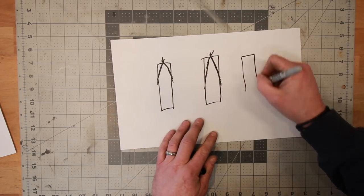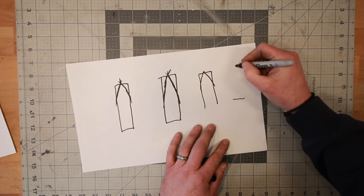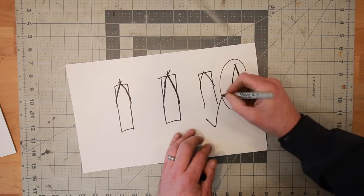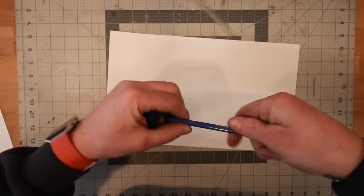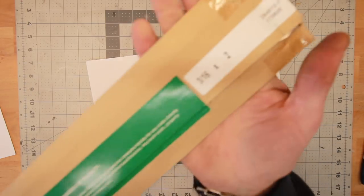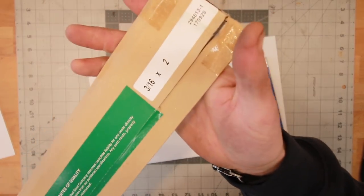I've tried just taking a piece of stock and just rotary platen like this, and that's kind of what you end up with. Whereas if you take one, and this is our cutting edge, and if you put in your flat grinds first, you end up with a much more gradual build towards your spine. That's what we're going for. All right, let's draw this thing. Going to be using a 3/16 thick tool steel, 2 inches wide.